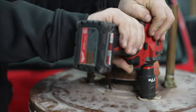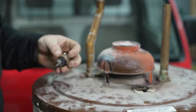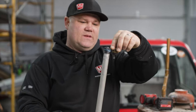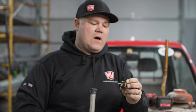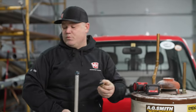The rod is completely gone — not surprised, it's a really old tank. That sacrificial rod has done its job — it's dissolved from a full rod down to just that. That's actually not surprising. More often than not, we see this on the really old ones. People will start to complain about the smell of their water if they've got well water and they've got that hydrogen sulfide bacteria present. That's completely gone.